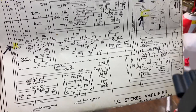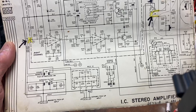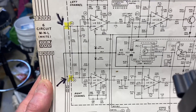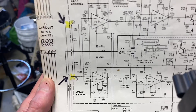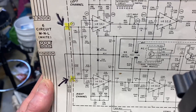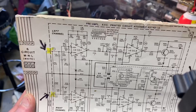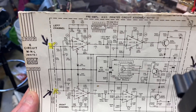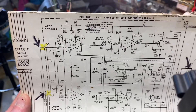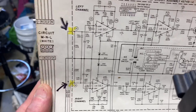If you have the luxury to get a wiring diagram in addition to a manual, it's helpful. This is the wiring diagram for the 444, and this amp is 45730. Just as an aside, if you had a choice between getting a 45730 amp or a 47160 amp at a yard sale, get the 45730. They're both basically the same except for one wire — the mute relay wire. The 45730 will work in the 442, 444, and also in the 448 through 451. That's a big advantage. The 47160 will work in the 442 and 444, but you won't have a mute relay. So the 45730 would be more versatile.